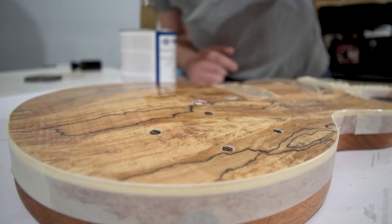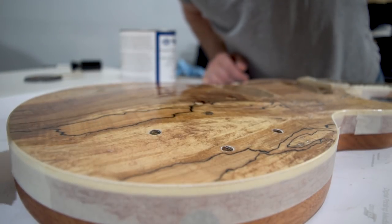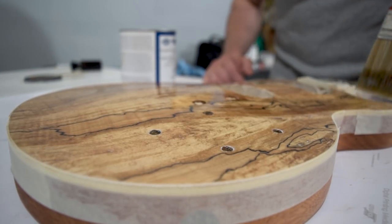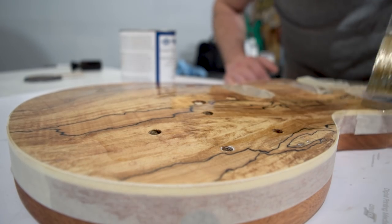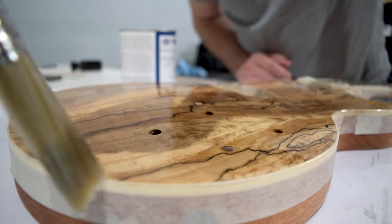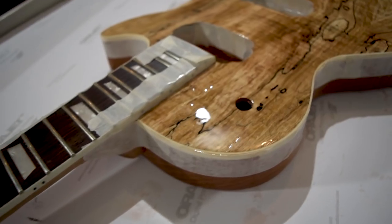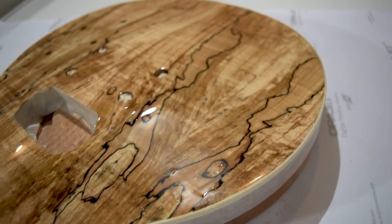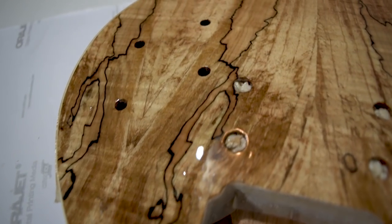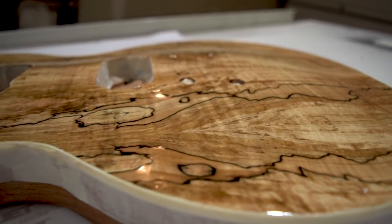Now that I've got it nicely sealed from that first coat and all smoothed out again, I can apply this one a little thinner. And it's a good idea to do that just slightly thinner this time because it does tend to build up a little quicker now that it's not soaking in and you are more likely to get those runs. Again, those are not a big deal — if they do happen, you can just sand them out and recoat or even sand them out and move straight to your polishing process. So once again, I'm trying to do nice long strokes. I have quite a bit of paint on this brush, so I am going to end up with a couple of slightly sagged areas, but nothing too substantial. And this is what we end up with — a nice beautiful gloss — something that we can flatten out in our next video and polish up to a beautiful mirror sheen if we want it, or more likely just buff it back to a beautiful semi-gloss or satin finish.